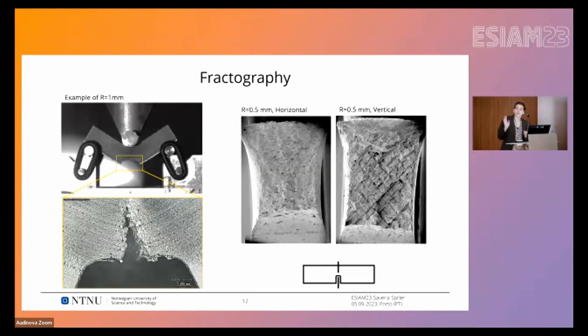I also wanted to show how much deformation occurred in the specimens even before fracture started. With the SEM pictures, we see the difference between horizontal and vertical specimens: the horizontal fracture is a regular ductile fracture with a lot of lateral deformation and dimples, while for the vertical fracture the crack jumped from layer to layer and exposed the ±45° raster pattern.